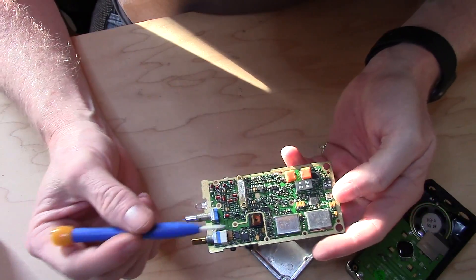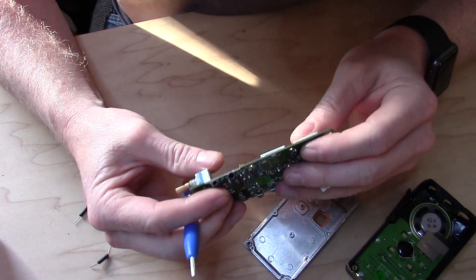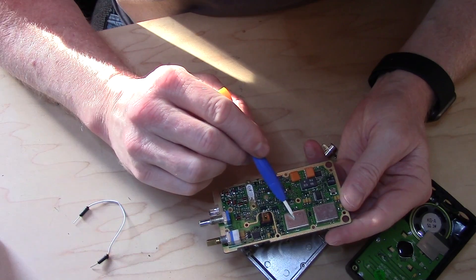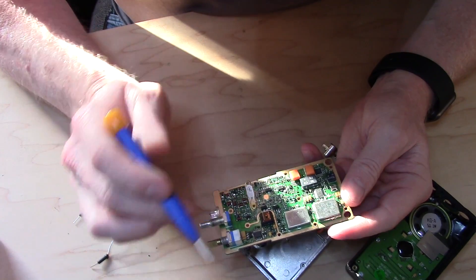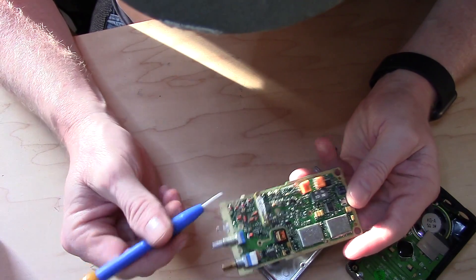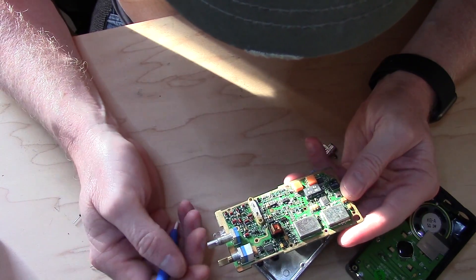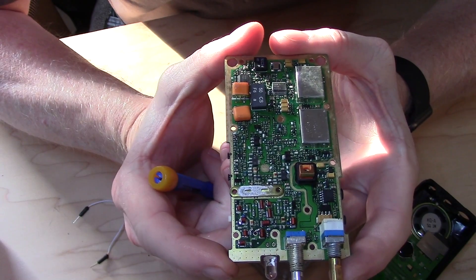Now to the side that I haven't seen before - I've got several parts here that are kind of swollen from the water damage. This is mainly the RF section and it's really densely packed. We have some things underneath these RF shields, and it looks like there's actually a conformal coating as well over all of this. Unfortunately it didn't seem to protect it from getting submerged in water. There are a lot of air wound inductors over on this side and what I'm assuming are small RF transistors. Overall this is really tightly packed - I'll get a good close shot so you can get an idea of the complexity on this side.